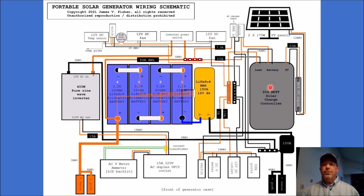We've got power into the battery — let's continue talking about how it is distributed. We mentioned that 400 watt pure sine wave inverter that is original to my design. As far as bringing DC power into the inverter, you've got a negative 8 AWG that connects over here to this main negative bus bar, and back to that positive — the positive line is going into that main inverter power switch on the back of the case, which will turn on and off the inverter without having to open the top of the case, but it's getting its power from that new positive bus bar that we are installing.